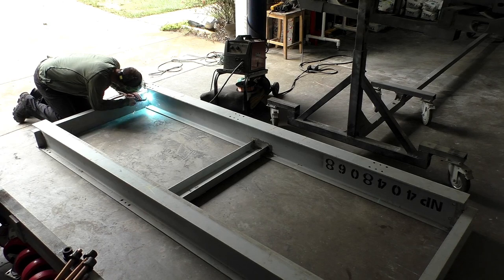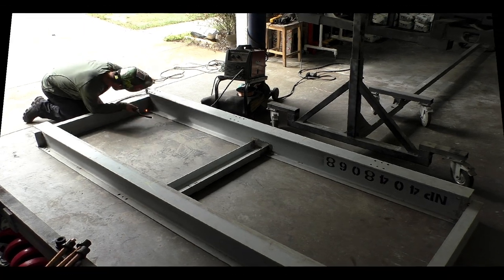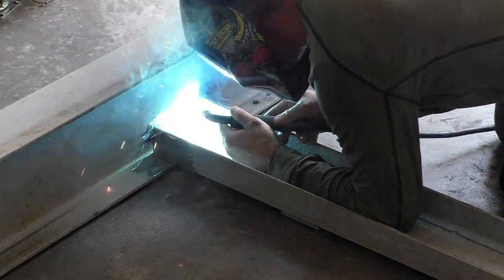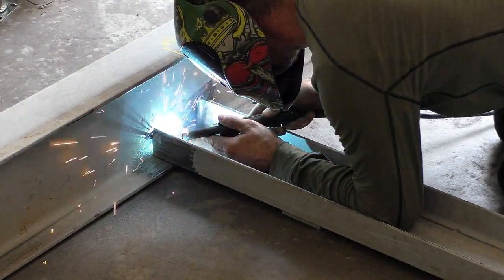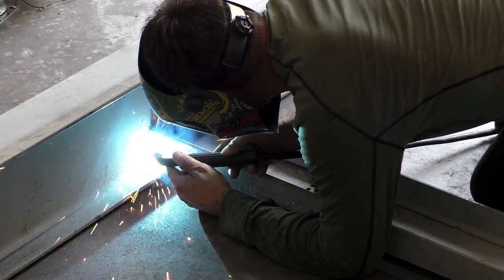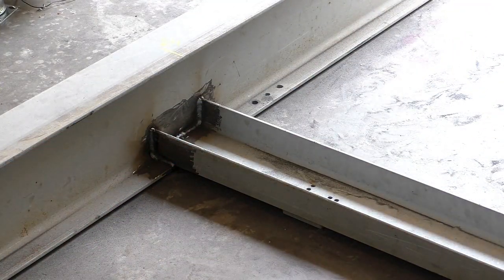We're squaring it up, kicking it over and making sure everything's good. We tacked it all in place while my wife was holding it, checked square, and tacked enough spots that it's not going to move. I'm welding now the whole bottom of the frame table completely solid. Make sure your welder is able to penetrate this - this is the largest size my welder is able to weld on a single pass. I also changed my wire size to 0.035, which lets me slow down the wire feed and get more consistent speed because the wire diameter is thicker - you can slow down the wire speed while still feeding the same amount of wire.